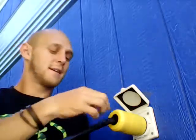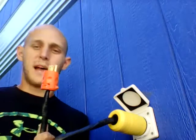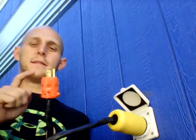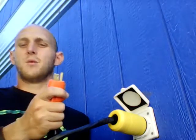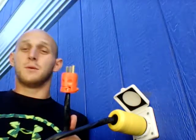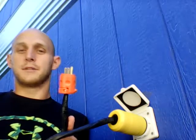If you saw part 1 then you'll know already that this is a 50 amp twist lock. It's basically been reduced down to a 30 amp 110 volt twist lock. This just twists and locks in here very easily and comes out very easily. The other side of this cord is this little piece right here, which I basically made myself very inexpensively, and it can plug into a normal 110 volt outlet. If you're parked at somebody's house or at an RV park, that's how you would do it and pay a very small electricity bill.